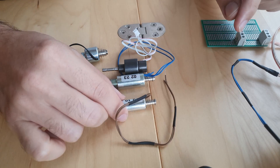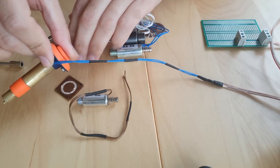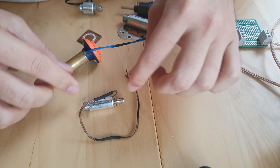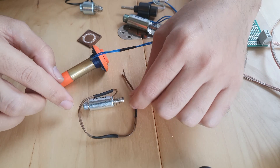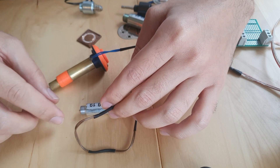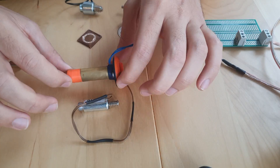This one is the 24-volt version, that's why it's a different color from the hand piece. I use the 12-volt version because I'm using a PSU of 19 volts. According to the datasheet of the solenoid, you can power up to 24 volts if the duty cycle is not above 25%.